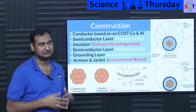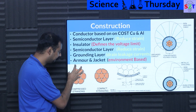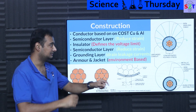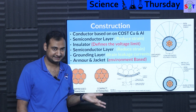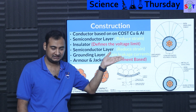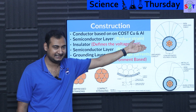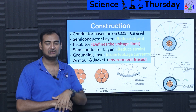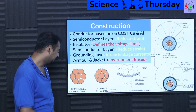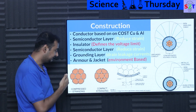But here's the deal: if you have uncompressed stranding — basically just circles stacked like this — you have void spaces. Those void spaces will be filled by gases. Consequence: you have ludicrously high voltage there, you will have plasma arc there — literally coronal discharge inside — and that will instantaneously destroy your insulation. So you compact it. Compacting reduces the voids and makes it more efficient. Compact is a bit more expensive; compressed is a good compromise. For very long cables many people use compressed, but if you can afford it, you go with compact. If you are burying it undersea, you will generally find compact; underground, compressed.